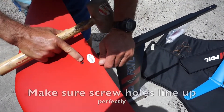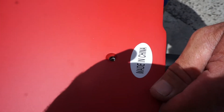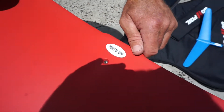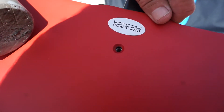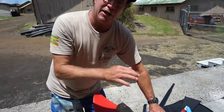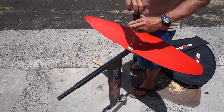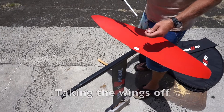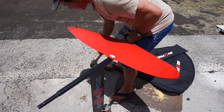Look inside here — look at your screw. You want these screw holes to line up perfectly. See how that looks like it's almost dead on? You don't want the wing to not be totally on so you end up getting the screw in there crooked and you cross-thread it, which could possibly damage your helicoil.